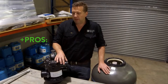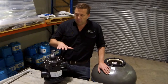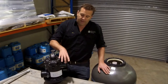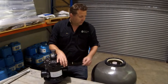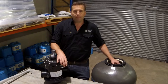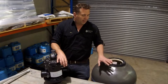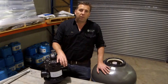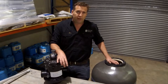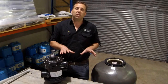Let's get into some pros. As I mentioned, it's eco, and what they mean by that is that it's all 50mm internal fitting. The multi-port valve is larger than a standard 600 filter because it has 50mm ports and also 50mm internals for the filter itself. The inner shell is fiberglass with spun woven fiberglass filament over the top. Internally it's got fishtailed laterals for a nice even distribution of water during backwash to avoid dead spots.